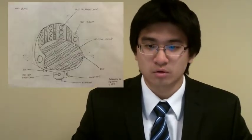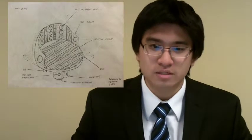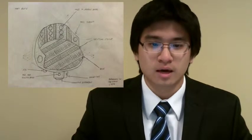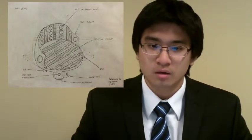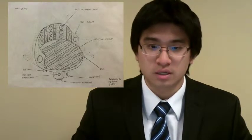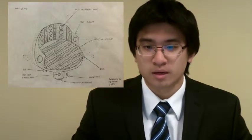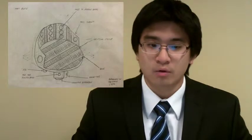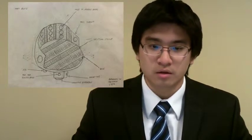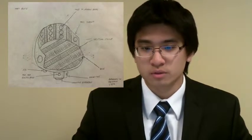The foot plate is a rotatable rubber plate 5 inches in diameter with a heel support in the back. Along the flat surface and along the heel support of the foot plate are friction strips that allow for maximum grip. The rubber also has a high coefficient of friction, ensuring that the operator's foot stays securely fastened within the foot plate and, by extension, the board. Our newly envisioned foot plate design allows for 45-degree clockwise and counterclockwise rotation. The rotation is accomplished through circular rails beneath the foot plate that are inserted to the connector.